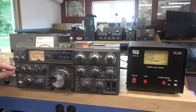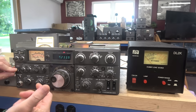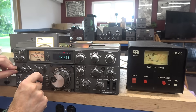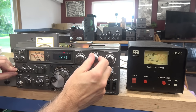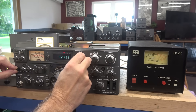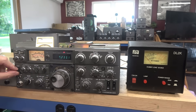Let's tune up the 830. ALC position. I'm in tune. Carrier level about midway. Peak my drive. Bring my ALC back into the usable zone. I've got about 20 watts out. Going to CW — dip the plate — putting out well over 100 watts. Here is my IP for sideband. Tune. CW. She's working great.